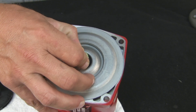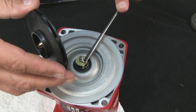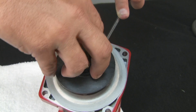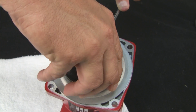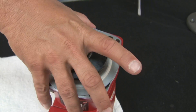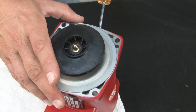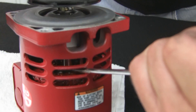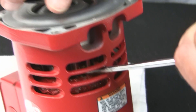Something that you can try is use a flat screwdriver and hold that spring in place so the tabs stay around the carbon. Put your impeller on and slowly work it onto the shaft. While you're spinning this, make sure that the motor isn't spinning. As long as you get the impeller started, you should be in good shape. I like going in the breather part of the motor so I don't have to tip it sideways. You can see the front side of the motor has little tabs on it also. I'm going to make sure the shaft isn't spinning as I spin the impeller onto the shaft.